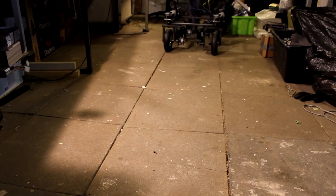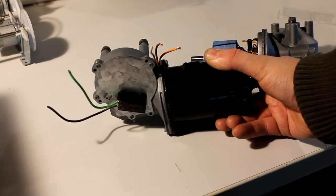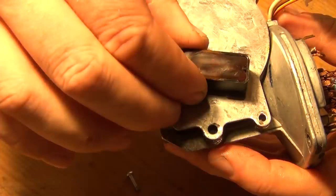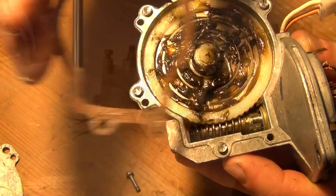So in the meanwhile, I have bought 10 of these old windshield wiper motors for 5 to 10 euros each on eBay. And we actually have to begin with a slight modification of these motors themselves. Now, just a reminder here, we find two wires on the back side of the gearbox. These lead to little switches or wiper contacts on the back side of the worm gear. You don't need them if you don't use the motors as actual windshield wipers. You can forget about them for now.